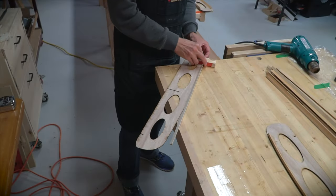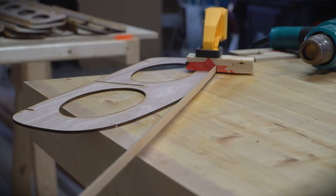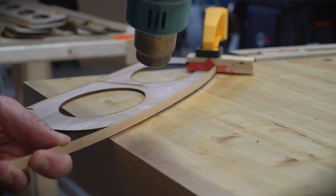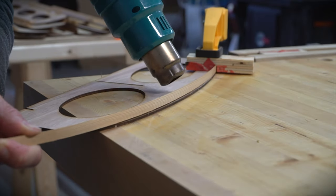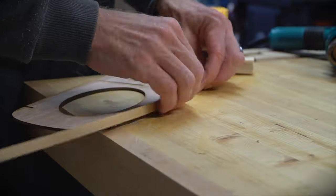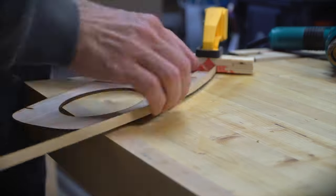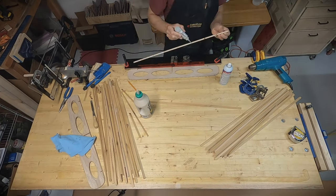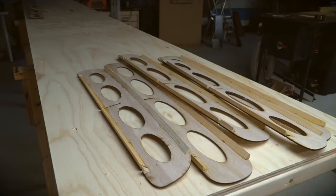The next challenge is that the deck of the paddleboard isn't flat at the front or back of the board, and therefore the frames in this area are curved as well. Pre-bending the triangle strips was really helpful in getting them to glue down nicely. To do this, I didn't bother with steam or anything like that — I just used a bit of warmth from a heat gun, and that's really all that's needed to relax the wood a bit and allow it to be bent. Take note, because this method is going to come in real handy later on in the build when the rail strips need to be bent to conform to the ends of the board. With a solid method of attaching the reinforcement strips, I repeated the process over and over until a decent pile of partially finished frames stacked up.